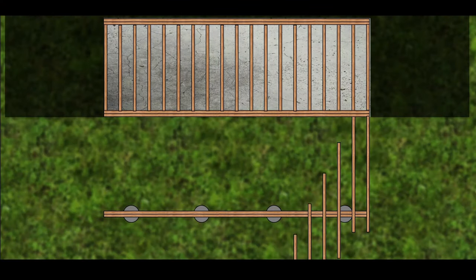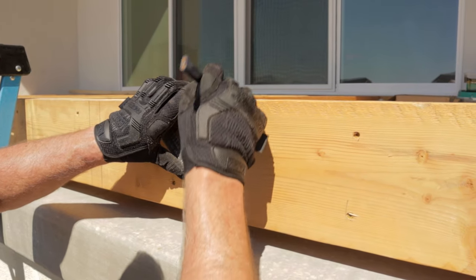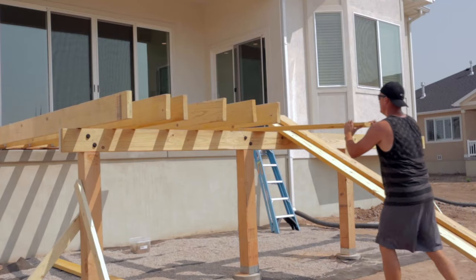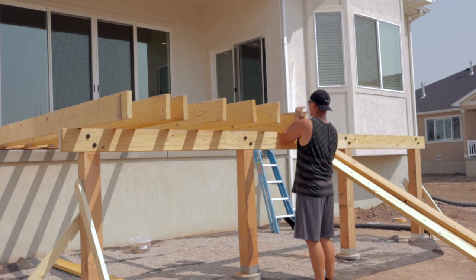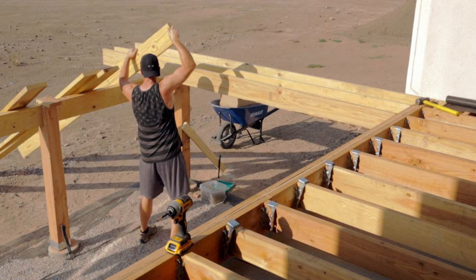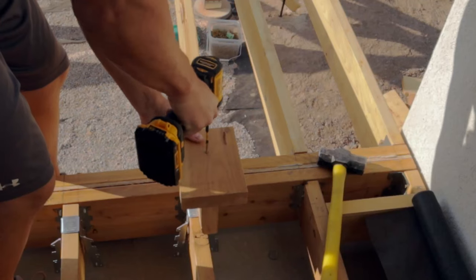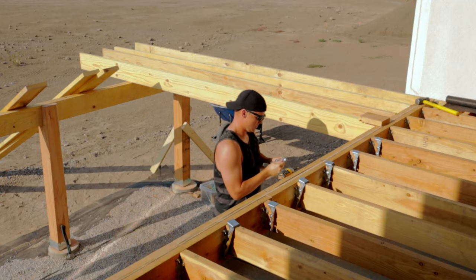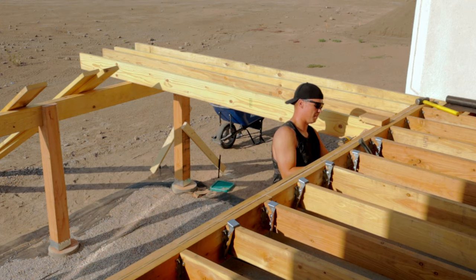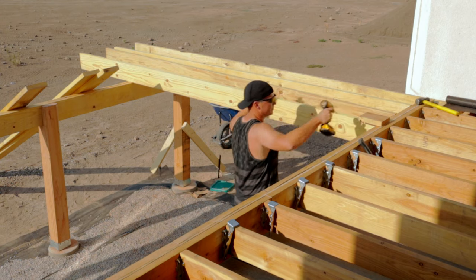Now that my posts are up we're going to start installing the joists. I ran a line every 12 inches on the beams to speed up measuring and looked for the crown in all my boards — you want the crown facing up so you don't have low spots in your deck. There's a common problem with composite decking where the finished product can look wavy. Boards often vary about a quarter inch in depth, so go through all your boards, measure their depth, and place same-measured boards next to each other when laying out your joists to minimize waves.